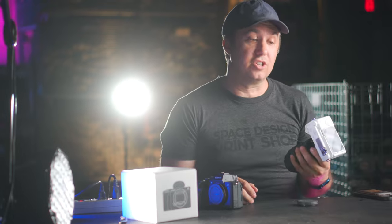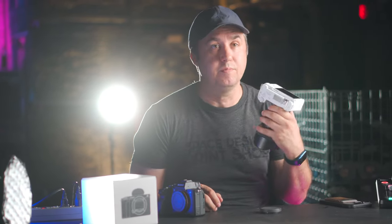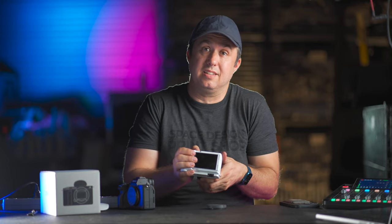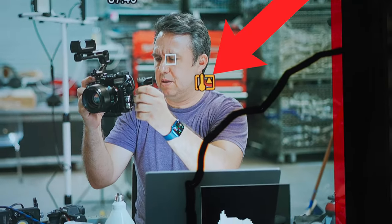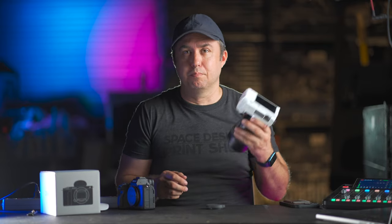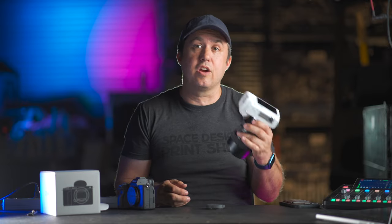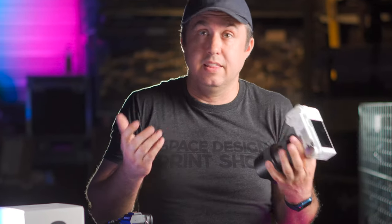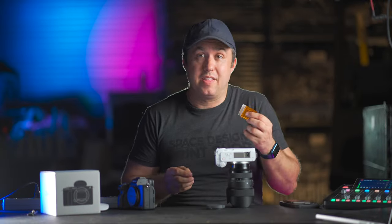The overheating issue. Unfortunately it's real. I thought maybe it would be a pre-production thing, but this camera is super compact, made out of plastic, and has no fan — plastic is more of an insulator than a conductor, so it traps heat. 37 minutes into recording the temperature warning showed up on screen, and at 40 minutes it had shut off. Now, I'm in a pretty hot warehouse in Orlando, Florida — 81 degrees, 27.2 for everyone else — with practically no moving air, so it overheated faster than it would in an air-conditioned studio. I did a separate test with a little fan blowing on the camera and it could record indefinitely. So in a controlled environment this isn't an issue, but if you're recording outdoor summer concerts in the heat for long stretches, this may not be the camera for you — at least not without modifications. I have a suspicion that a stick-on copper heatsink will solve the problem, and I'm going to try that next.